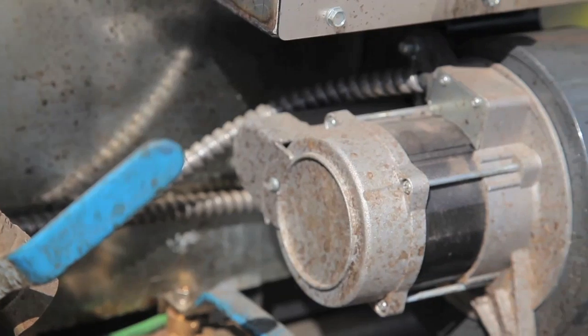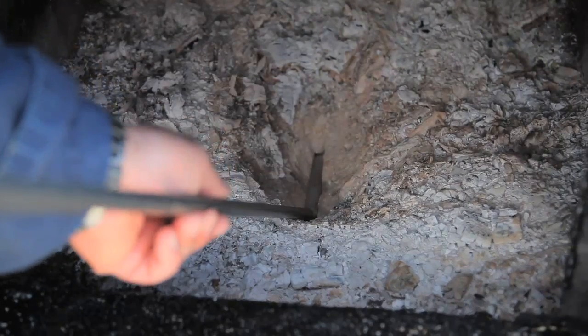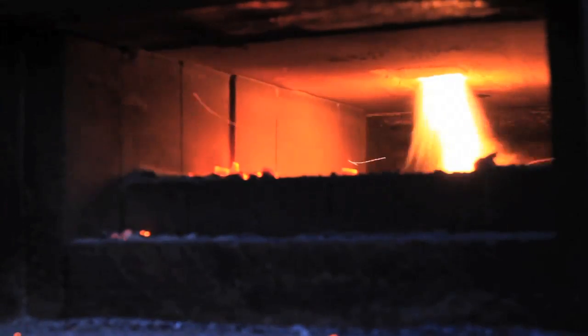Few people realize how wood gasification works or how impressive it is to see firsthand. In the case of my wood boiler, a fire is lit in the main firebox and then the sealed door is closed. Air is admitted to the fire through a small electric fan. This supports combustion of the wood itself. But the only place for the smoke and gases to leave is at the bottom of the firebox, through a thin slot in the refractory material. This action compresses the gases and causes them to burn a second time at high temperature in the gasification reaction chamber underneath the firebox.